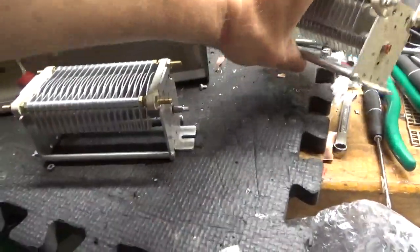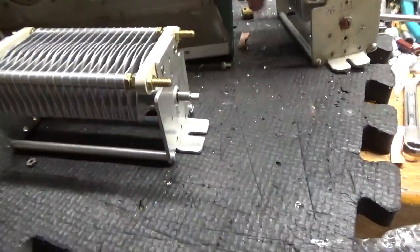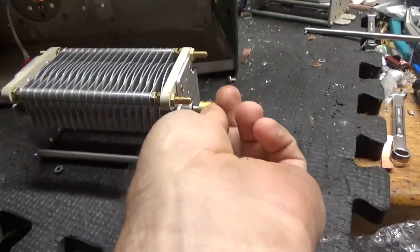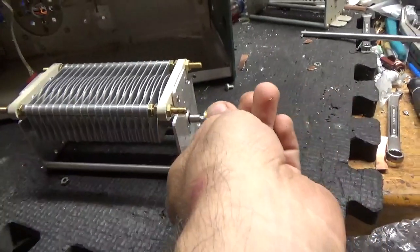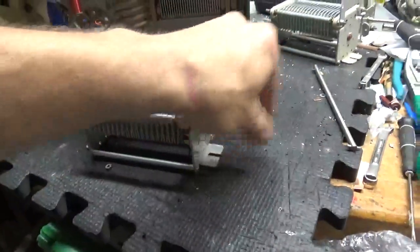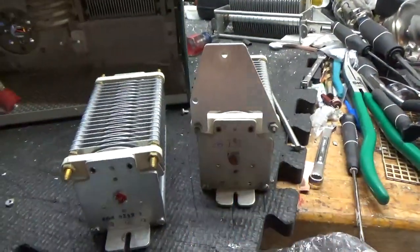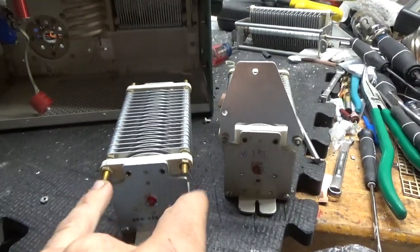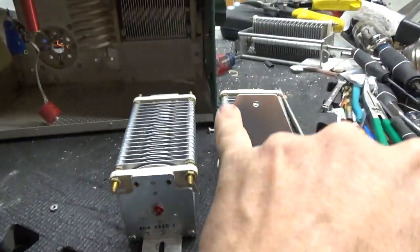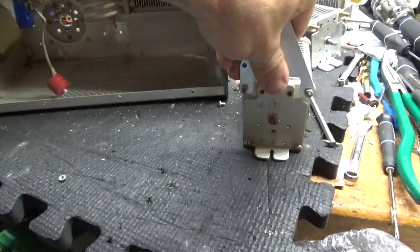What we're going to do here is cut this little nipple off where that plastic piece is attached, and use a shaft coupler — slide it over this portion right here — and then cut a shaft to extend out through the factory hole. The only other difference is this one has 6-32 screws coming out the back, and this one has larger threaded studs. So the holes on this bracket would have to be enlarged.